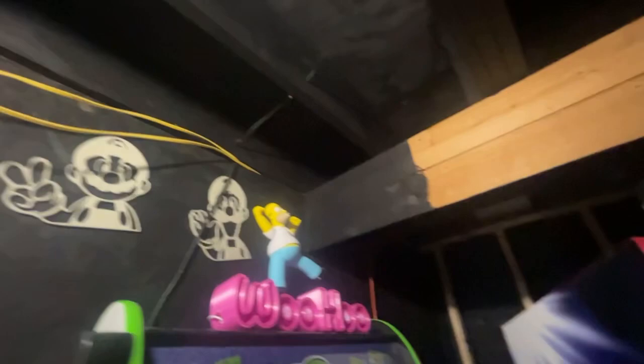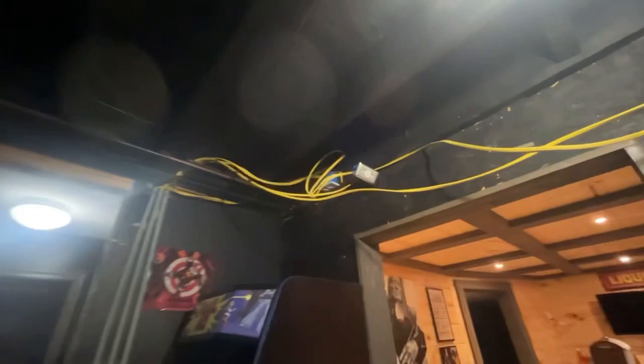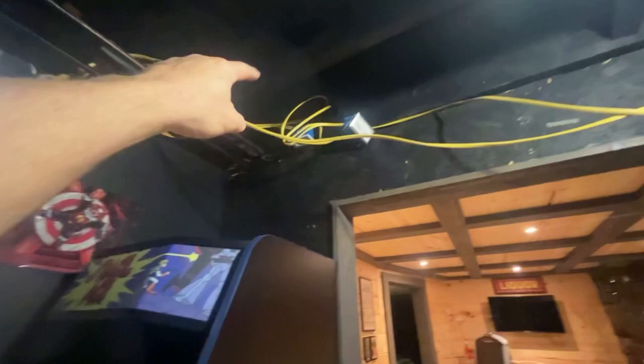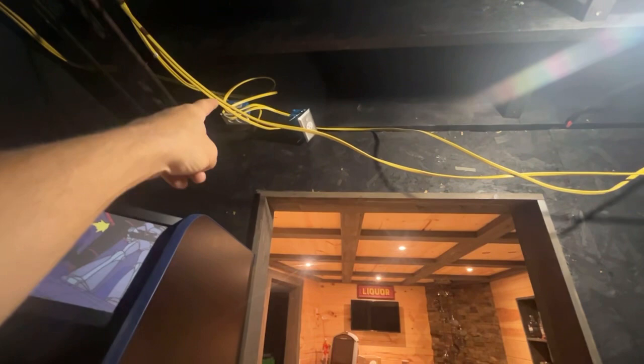Luckily over here in this area I don't think there's really any plumbing. And just like if you needed to run any additional electrical. These electrical wires right here are actually new — they were run for the arcade. These are new circuits. I have to figure out which ones they are on the fuse panel. What I'm going to do is probably put a junction box in and run them over to where I need to. I can put a junction box with a cover on it in the ceiling because it's accessible — I can always drop a panel down to get to it.